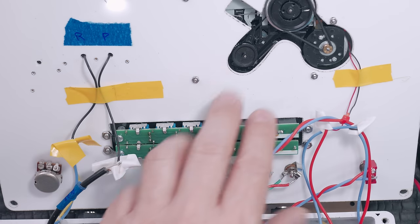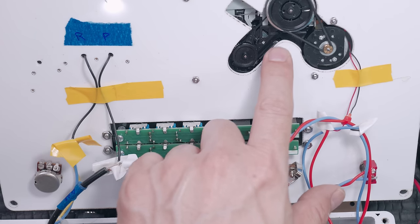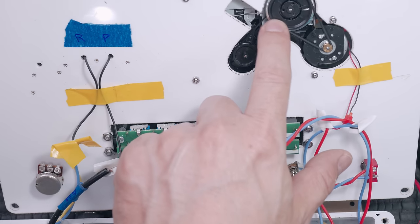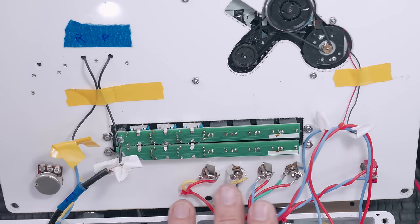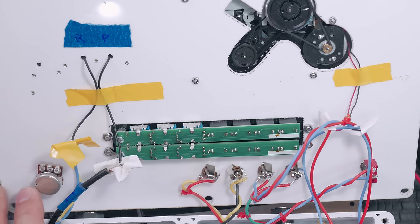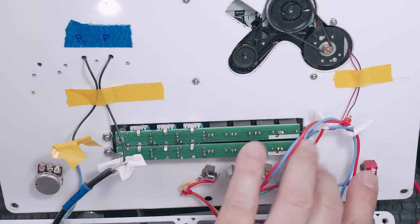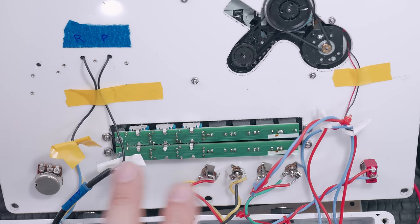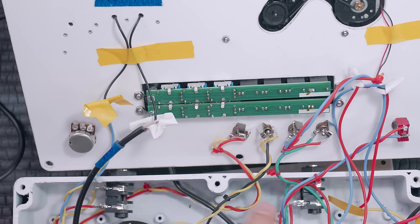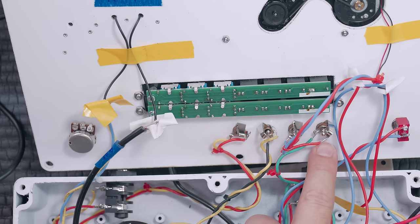You have the two mixers. I've lasered out the cavities here so that the Walkman device can actually seat in here and it doesn't interfere with that flywheel and the motor. And then I have the patch bay here, 1, 2, 3, 4. These are 1/8 inch cables. Here's the pot that's unwired yet because we haven't decided where that's going to go. And then here's the switch that is wired to both Walkmans that turns them on. This would be your out jack that goes into the amp, and this is your in jack where the guitar cable comes. And of course, the in jack is wired straight to that patch bay right there.